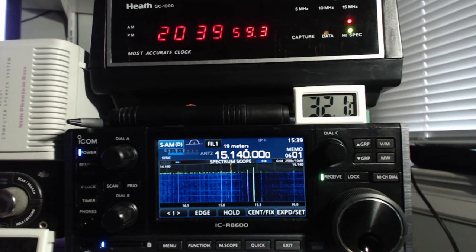That's a one-hop ionospheric propagation zone. So, Amigo Bryant, here's my advice. If you are on CW, call CQ a few times, especially on the QRP calling frequency of 14,060 kHz — that's the one I recommend. Then connect via internet to check the Reverse Beacon Network, the RBN, for your callsign. If you have any location appearing on the RBN screen, you stand a good chance of making contact with whatever power you're using, be it 5 watts or 1 watt.